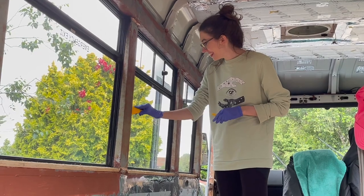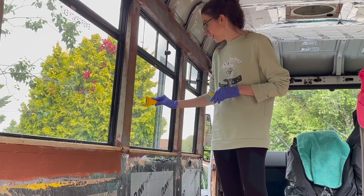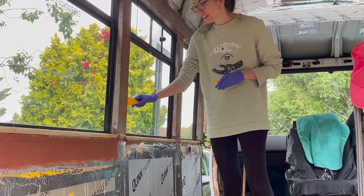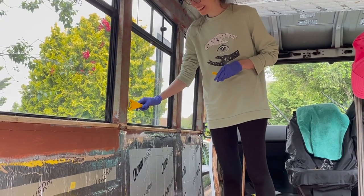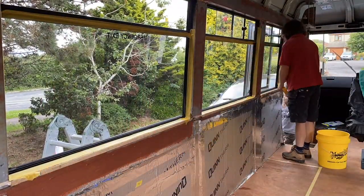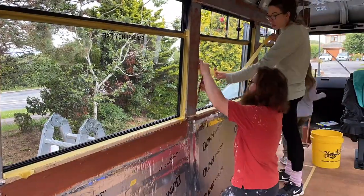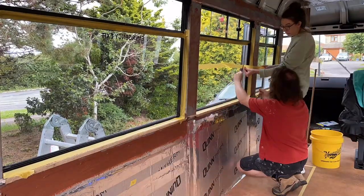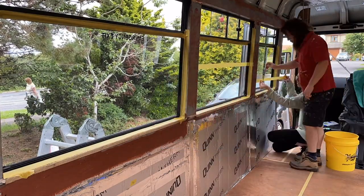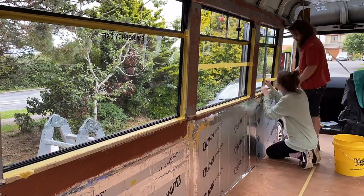Yeah, scorch marks. We're just cleaning it before we mask and paint it, because we want to mask and paint this window but those little marks on it — we don't want to see them from the outside — hence the cleaning. Also the paint won't adhere as well without cleaning. We're taking the top window out. This bit took a little bit of time and we made provision for the splashback to stand at about 110 centimetres, so we'll have about 20 centimetre splashback, and then at the end we did decide to make sure that runs at about the same height as the countertop.